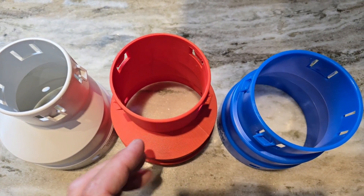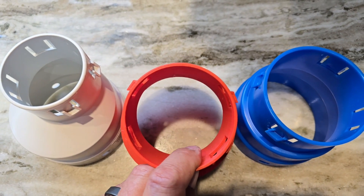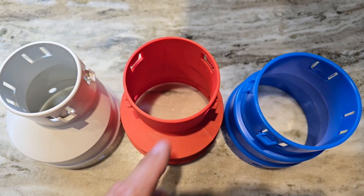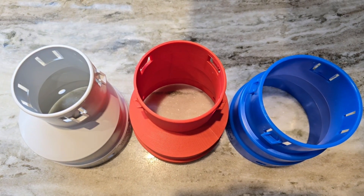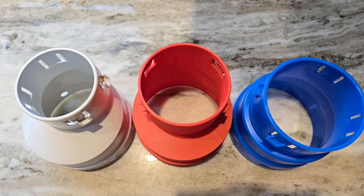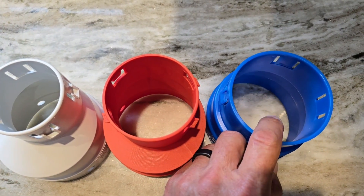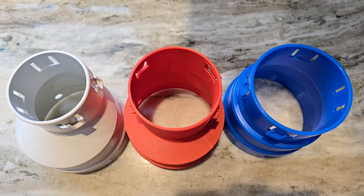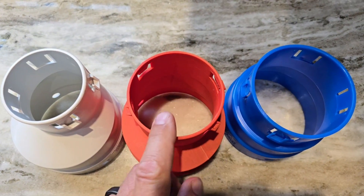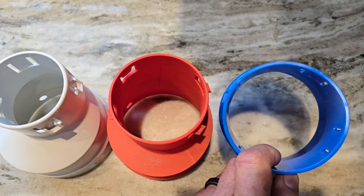We put that somewhat in the middle — we gain 36% right here. I love the idea of three and a half inch. If we had a three and a half inch corrugated pipe, I would run all my French drains with it. All my collection points would be three and a half, and I would still go to trunk lines that were four inch. And I would love to run this off downspouts — it's a more user-friendly size and it's not going to clog like the four inch pipe.